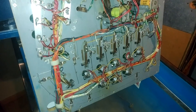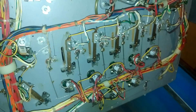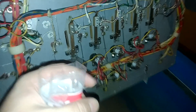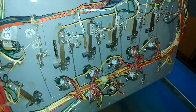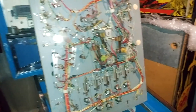The next job is to clean and adjust all switches. There may be some bad switch diodes, but the first step is obviously the cleaning. I'm going to use these contact cleaning strips, which we basically just place between the switches, apply pressure, and then slide them through. That cleans the contacts up without abrading them.